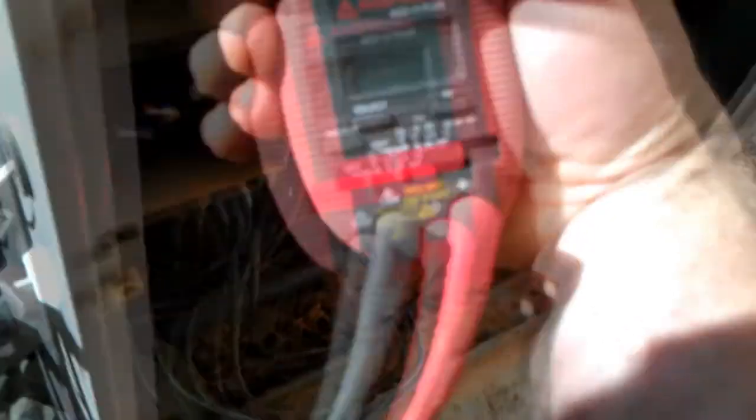So now when I tap the contactor on, the inrush current flows through the wire — which I'm sampling — going through the start capacitor there. So fast you can't even see it. This will be just a little flicker on the digital meter. You can see that it's definitely starting this compressor. See, it's fired right up. The compressor is running.